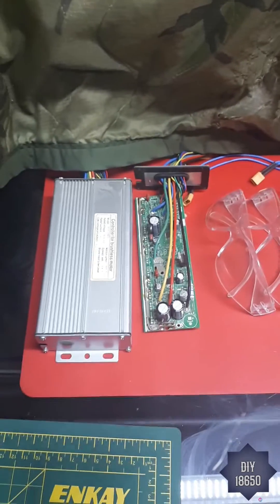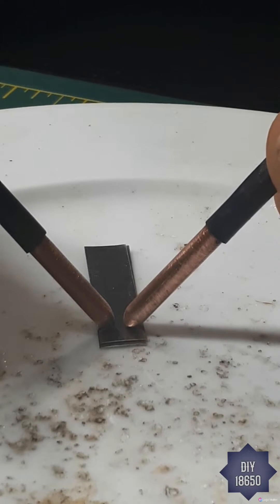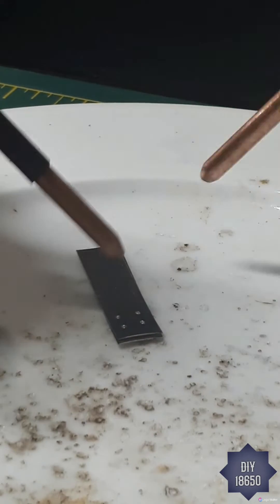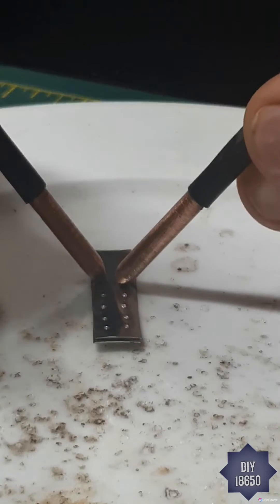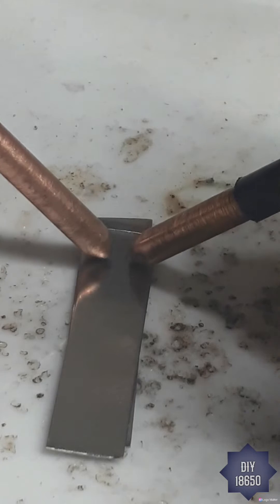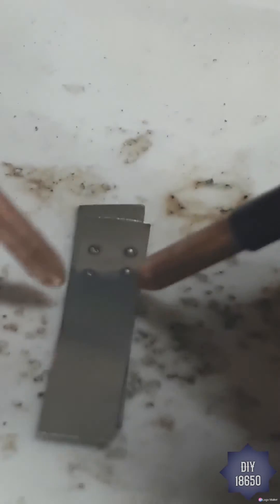Here's some more welding — a little slower. This is the pace I like to weld at, so this is a good example. The welder itself doesn't even get warm — doesn't warm up or change temperature. I think it's just the amount of MOSFETs: they're 440 amp peak each, there are 10 of them. They're not being stressed at all, and it's such a short pulse with so much aluminum that there's no heat buildup. I imagine you could probably bang them out super fast.